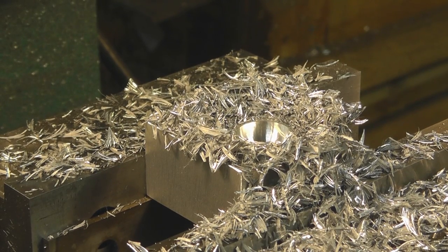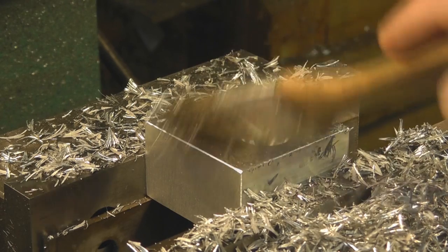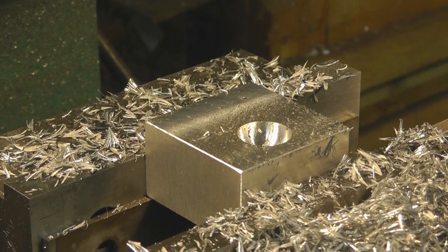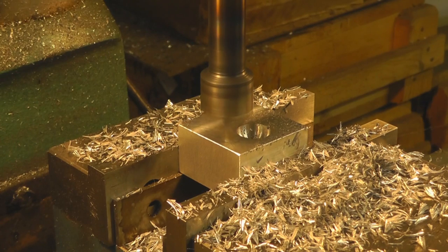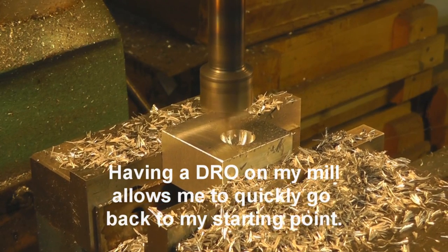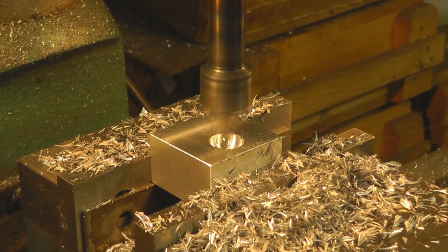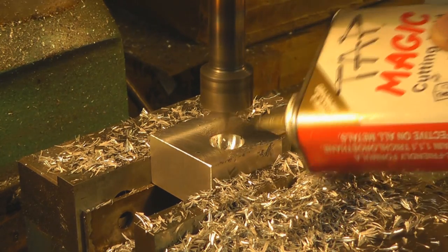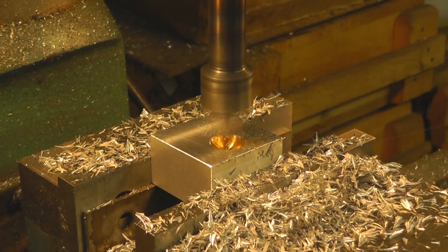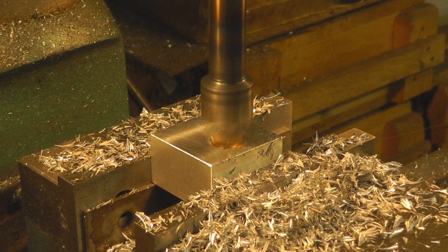Right there we went exactly half of an inch. We'll use our custom cutter to finish the hole. This is a three-quarter inch round end mill we're using — our hole of course is going to be one inch, so we've got less metal to hog out. Now we're touching our mold block — it's zeroed. We left a small mark on it. Our mill table is now zeroed again. Put some cutting fluid in here, fill that hole up. Now we will see how well our cutter works — I do not know how well this is going to work.